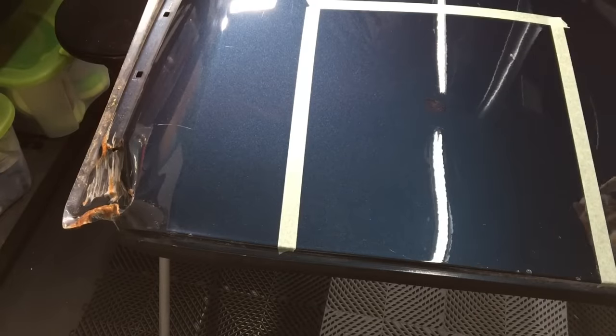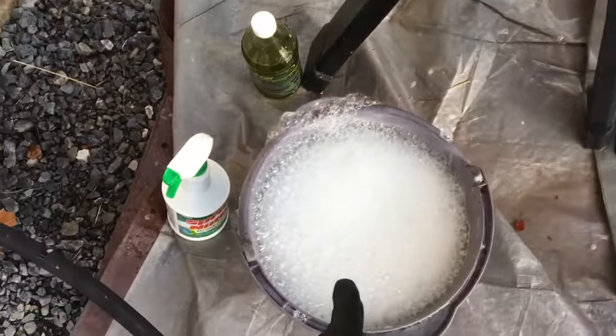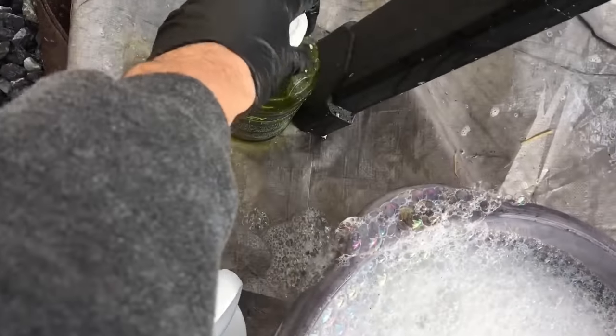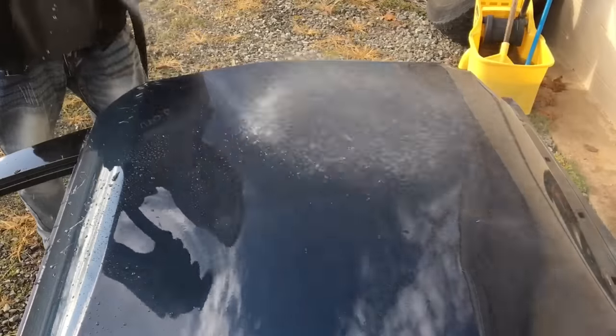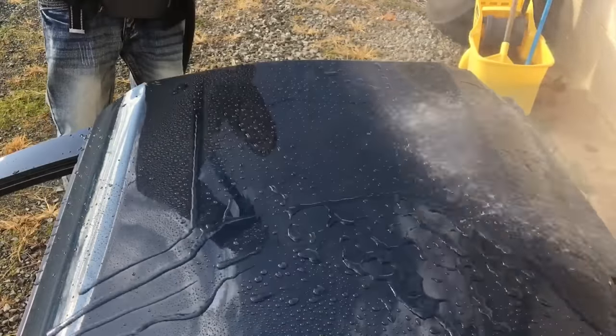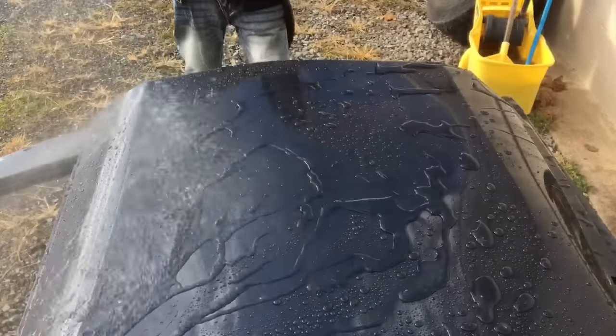All right, held in place until we exceeded 210 degrees, and you can see the time and date now as we are starting the chemical resistance. And just to show you outside that it does make the panel darker and richer. It is just a little bit blotchy, not quite as consistent all the way through as I've seen other products, but not bad. So we have our mixture, the torture, spray 9, and the shampoo, so we can clean in between rounds. I'm going to keep my mouth shut. I'll go through the rounds here, but first I'll give you a little taste of beading.